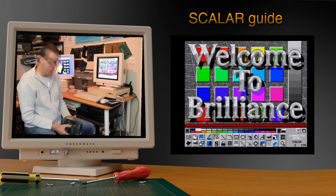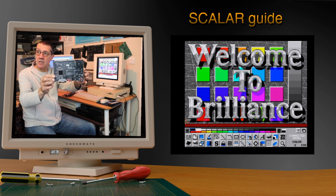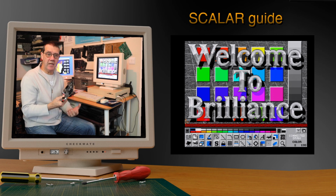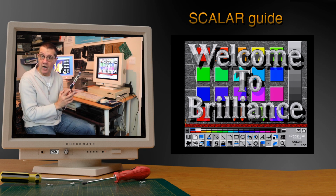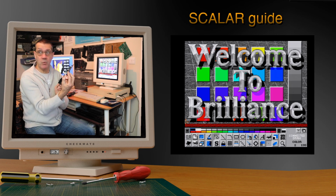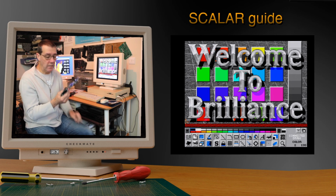So let's get away from that. The Scalar is basically a plug-in board that goes into the monitor, okay? And what it does is it takes a 15 kilohertz old retro signal either through SCART, RGB SCART, or through RGBI, which is this little 9-pin, which most of you won't recognise, but that's like CGA and EGA and Commodore 128 outputs, some other displays.